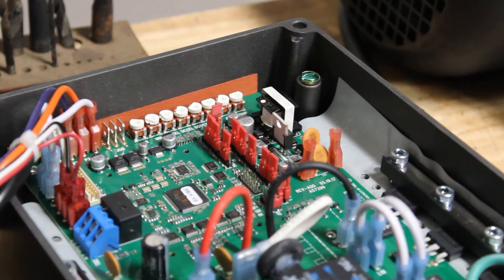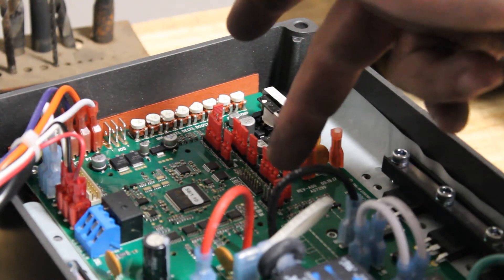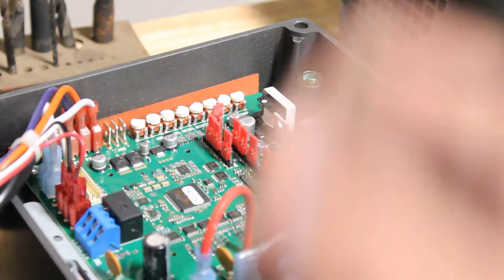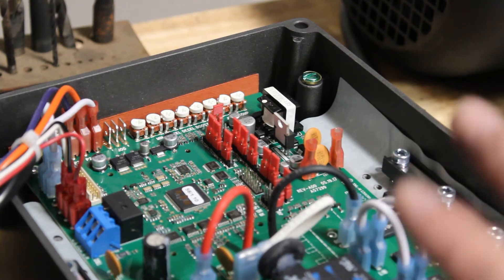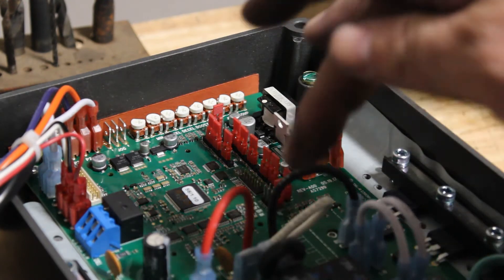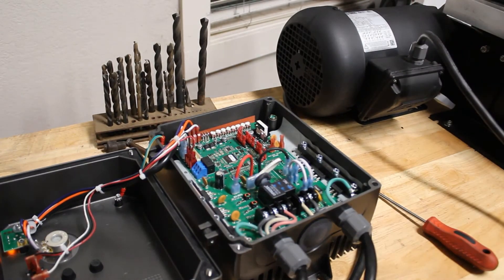You can get away with a lot of other things in the shop, but I bought a totally enclosed fan-cooled DC motor. I wired and built this out of a bridge rectifier and some other stuff. It's got an RPM gauge — the sensor picks up how many times the little magnet spins around on the fan, which is pretty close to the revolutions of my 7-inch drive wheel. I also added this work rest, which doesn't come with it. It's a totally enclosed fan-cooled 2-horsepower motor that spins at 1,750 RPM.